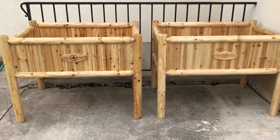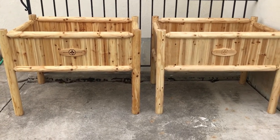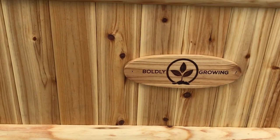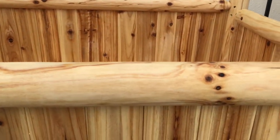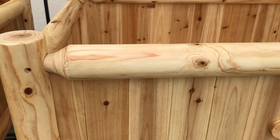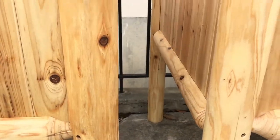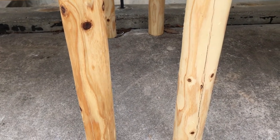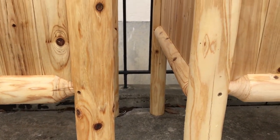Here's a closer look at the two planters. The one on the left is the tung oil planter and the one on the right is the shellac-coated planter. The logos are a little misleading because the tung oil planter's logo was darker to start with. But if we look at the knots on the tung oil planter, you can see they're pretty dark and quite accented. Moving to the shellac one, the knots are still there but just a little bit lighter, and the overall tone is lighter — it's not a lighting issue, the shellac is simply lighter.